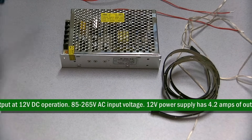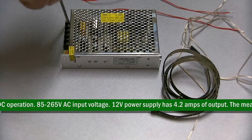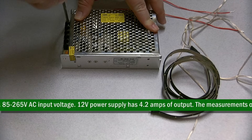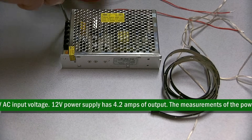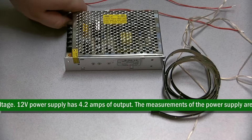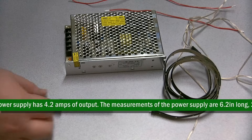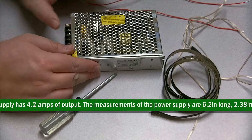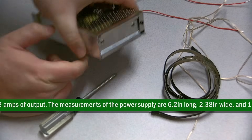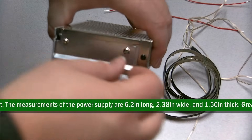To change the voltage range or change the fuse, simply remove the screw located at the front of the power supply to the far left away from the green LED. Then on the backside, remove the black plug — just pull, it should come right out. After you have removed the plug, slide the grate from the front to the back; the grate should just now lift off, exposing the innards of the power supply. Now be very careful — try not to touch anything but the switch or fuse.